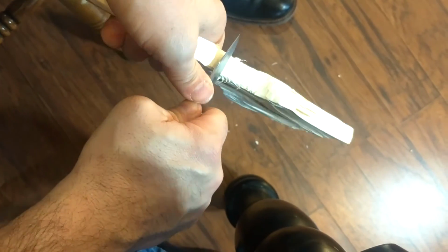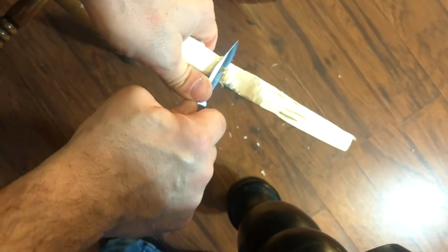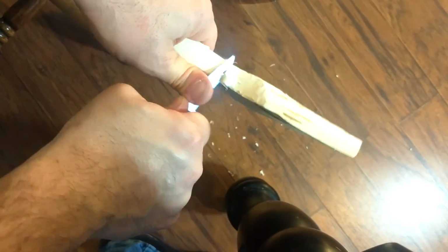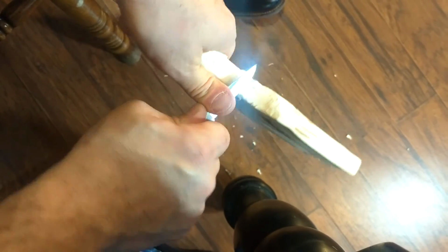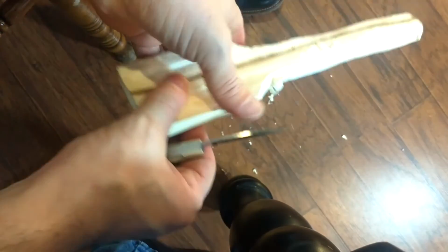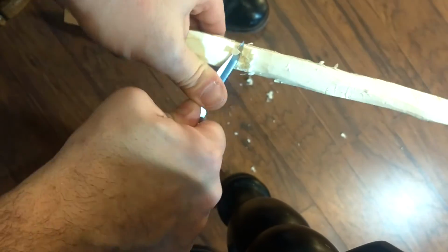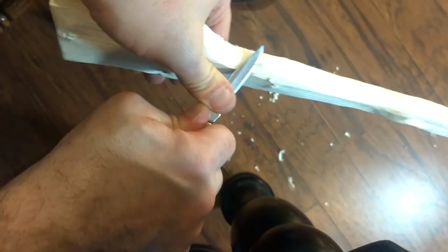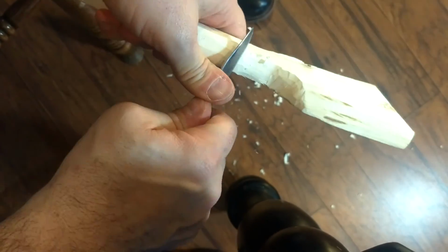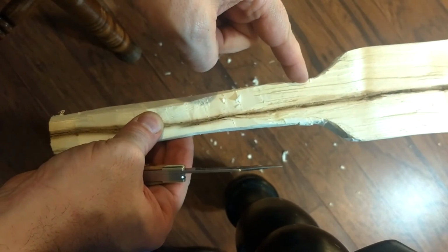You guys can see here. Oh, that's the other thing I was going to mention: when I was using the hatchet, and the same principle applies now that I'm using the knife, this angle, this cut, I don't just exclusively approach it from one side. What I mean by that is, see how I'm coming at it from this side? Now before I dig down way deep and go into the grain of the wood, which will cause me to have to go all the way, I switch it up and I match it up so that way it meets the other side right there. So as I do this and I lift it up, as you can see here, I'm finding that same piece and making it smooth. So that way I'm not going in. Hopefully that makes sense. So just wherever I have these at these angles, I come a little bit this way and a little bit that way and match it up.